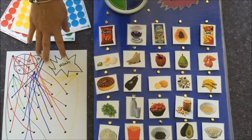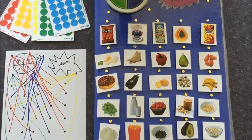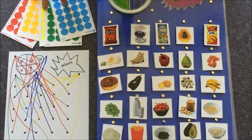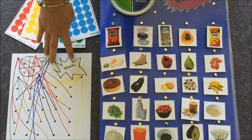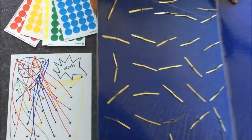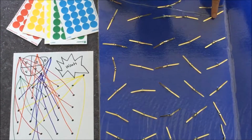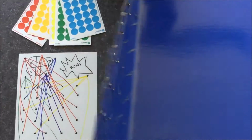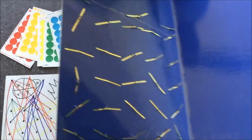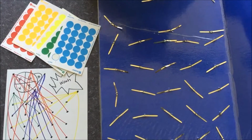In addition to creating your map so that you know which brads correspond to the correct answers, it could be helpful to add some dots to the inside of your board so that you can easily and quickly wire your circuit, and just in case for some reason your map gets lost, you will always know what the circuit is. So as I open up the board and you see the back side, you can actually see where here I've wired one brad to another already. But if we look at the front and we see that dairy is right here on this brad, I'm holding my finger to it on the back side, and then I can just stick a blue sticker here so I know this is dairy.